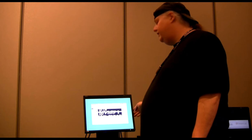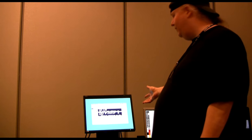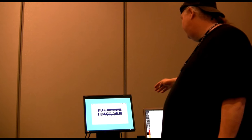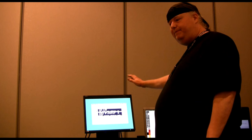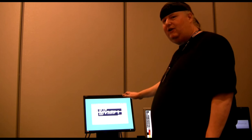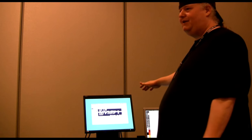And this monitor works good. It'll do both signals, NTSC and PAL. It's really nice. That is an NEC monitor? Yes, it says NEC multi-sync. Was it 1880SX? It says multi-sync, and I was hoping maybe it'll do 15 kilohertz. It doesn't do 15 kilohertz, which is the only thing I'm kind of bummed about.